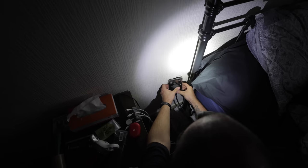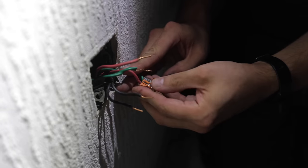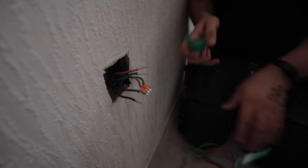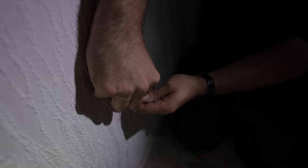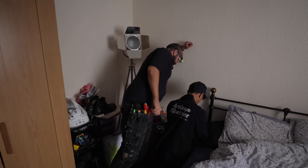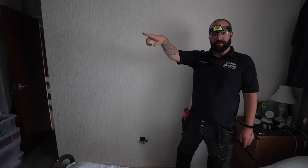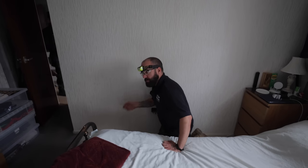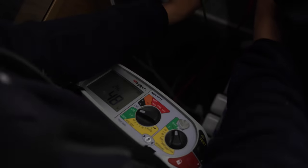It seems a good connection - it's all the same, really really rubbish reading. Normally I leave my croc clips on there squeezed together from a figure of eight, however I'm getting a really bad reading at one of my sockets. I'm just going to stick this in a Wago so I can free up my leads. Two thousand years later - yeah, that's still the same. We're getting an incredibly high reading at that socket - 22 ohms on R1+R2. I'm not alive - I don't think it's on this circuit, I think it's on the kitchen circuit.